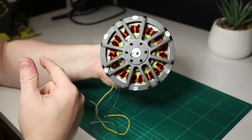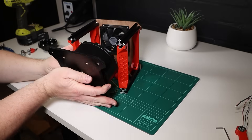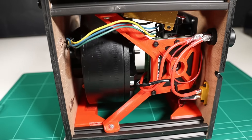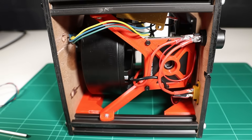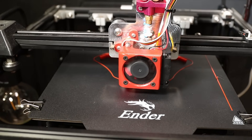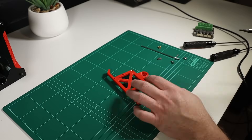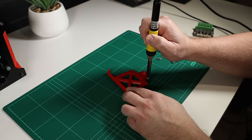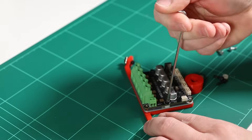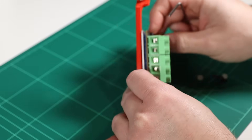So I put the motor back into the housing and started connecting everything back up. Unfortunately the motor is a tad longer now so I had to shift the motor controller around again to make it fit. I ended up printing a new mounting bracket that combines the controller and encoder mount into one piece. The new mount has M3 threaded inserts in the back so I can easily attach the controller to the front of the mount, providing heaps more room inside the housing and even allowing me to do a better job with routing the cables.